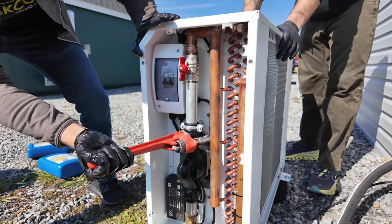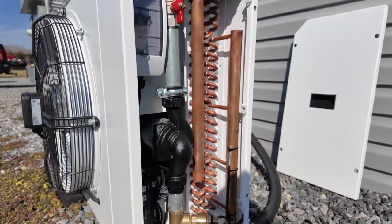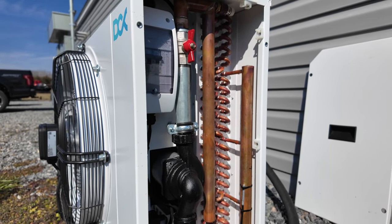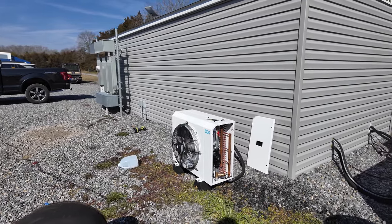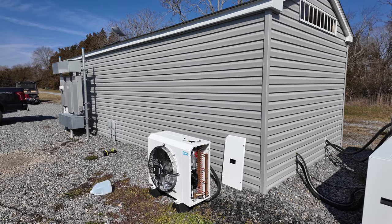So when you're pumping this up, per their installation video of the bigger unit, and I was not able to find an installation video or guide on the smaller unit, crank it up to 1 bar. And in doing that, the system is not holding the pressure here, even though we went ahead and tightened it down further. However, we're probably at about half a bar on pressure. It seems to be barely leaking, or kind of stopped leaking, maybe. I mean, it's still wet, but it's also coolant, so it's very slow. It's a mixture of coolant and water, so it's very slow to dry and evaporate.